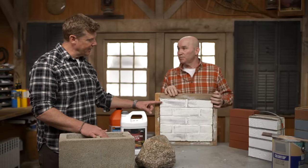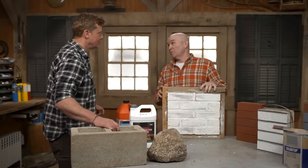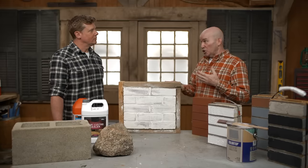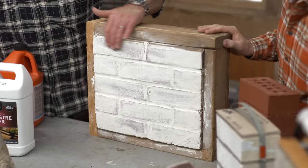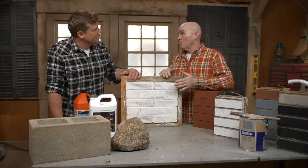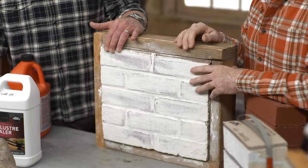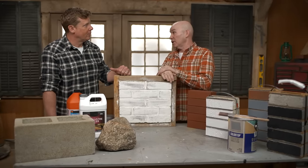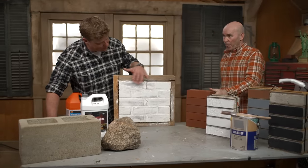So that is our sealing process on the outside. Now, this is for protection — what about changing the look? I know you hate paint. Well, I hate paint because it's not what we want. We want our product — the brick or the masonry — to breathe. Once you apply paint, it's a complete seal. Any moisture behind the brick can't push its way out, and that's when you see paint start to chip, start to warp. So instead of paint, what do you like? This is what we call a whitewash — it can be done with white Portland cement, and you can also use a white stain to mimic this process. Stain will penetrate the masonry surface, and once it gets in there and solidifies, it becomes the repellent. The best thing is you can do almost any color.